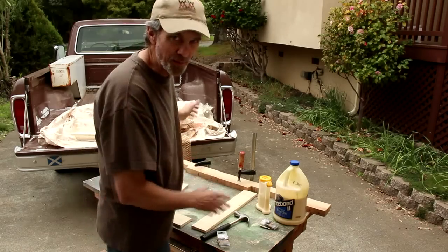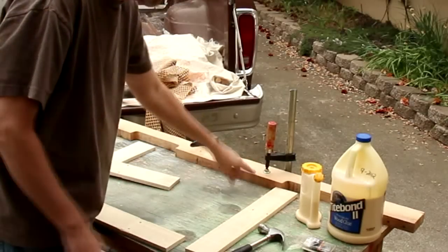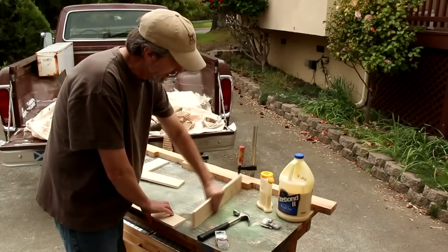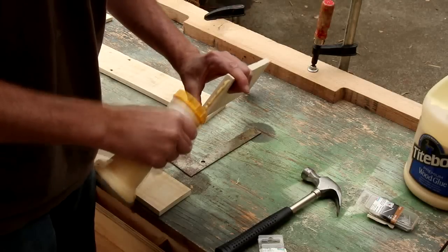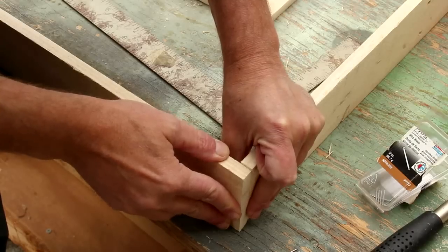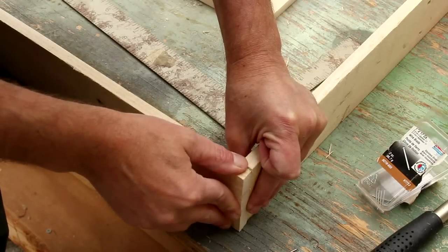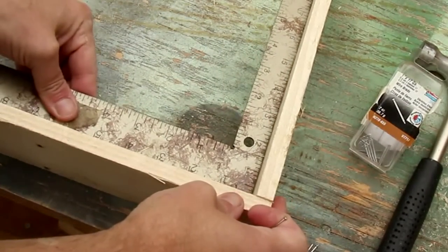To assemble this I'm going to glue it and nail it together. I've also set up this board back here that's just going to give me something to hammer against. When you get that glue on there, just hold it in place for a few seconds until it starts to grab and it'll be a lot easier to put the nails in. And if you have one of these framing squares you can use that to make sure that it's square.